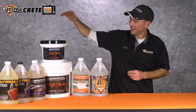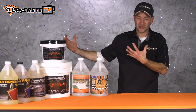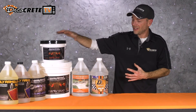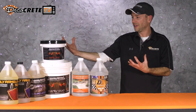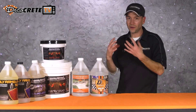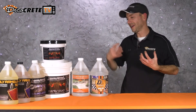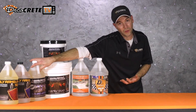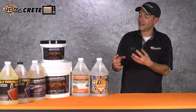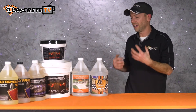Now moving on to concrete coatings — things like epoxy, polyurethane, or polyaspartics. These coatings don't always start their life out as a solid substance. A lot of this stuff is actually a byproduct of some other manufacturing process. That means these aren't gonna just get hard on their own — the resin itself will still be a goo, and we actually need something to start a chemical reaction. That's why we have a part A and a part B — we mix them together and that's where our film comes from. Even rock-hard urethane with no part B is still considered a two-part product because it's a moisture cure urethane — once spread out, it grabs moisture from the air to start that reaction.